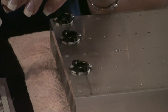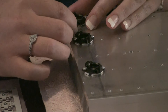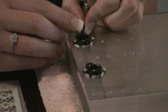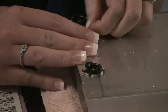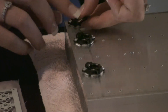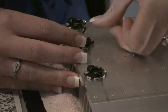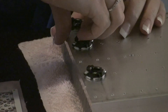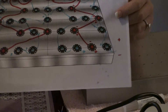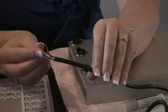Be sure to keep your LEDs in correct sequence from positive to negative connections — this is called a series circuit. Strip off one quarter inch before inserting the wire into the solderless connector. I made a layout so I can keep track of my LEDs to make it easier when it comes time to wire them up. It starts with the positive red wire from the driver to the positive post of your first LED.